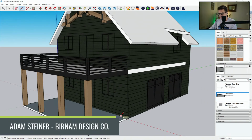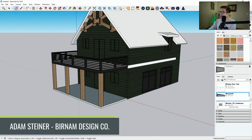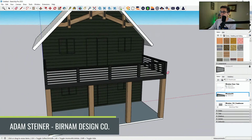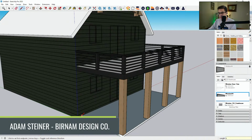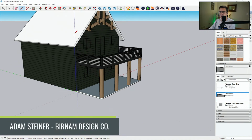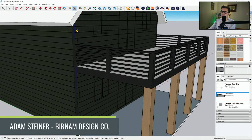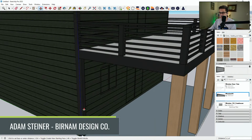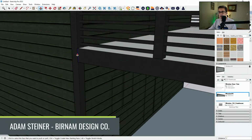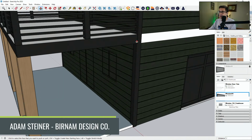So nowadays, with most siding materials, unless it's like real wood, they're not lapping the corner with the siding material. They're usually butting it into a corner board. So it's pretty common to have them on most normal construction. As you get higher end, you can start to see them eliminated, but most of the homes that are built have corner boards. Especially if you're doing vinyl or something, you need an end channel to receive the vinyl. I like to bump these out an inch. Out, not in. Just to show some dimension on the rendering. It'll cast just a slight shadow, which is nice.